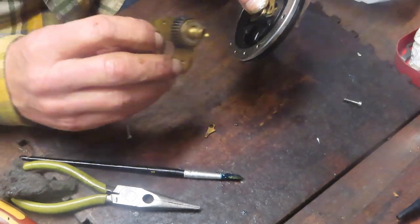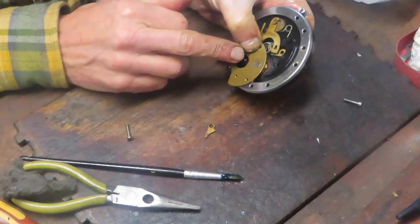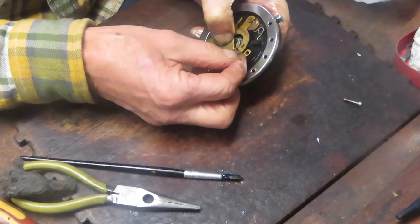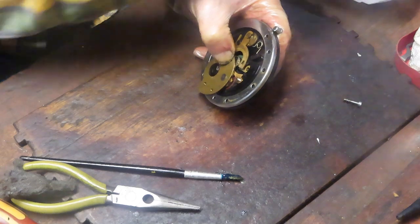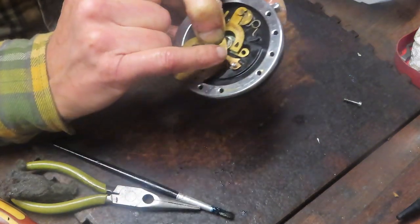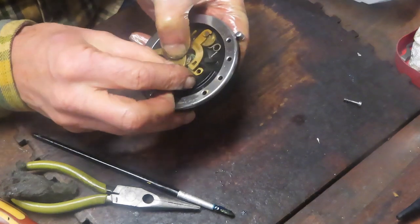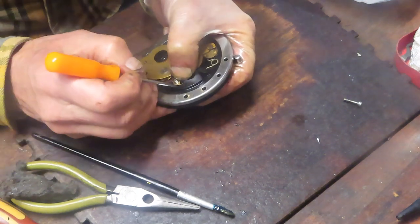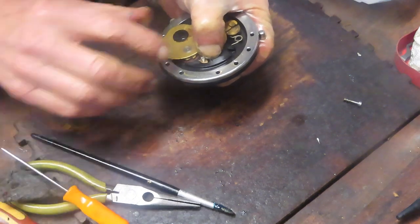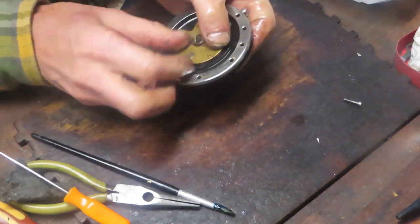We're going to find a fully threaded screw — we've already lubed up the bridge plate and everything is clean. Take that bridge plate, insert it in now, then turn your bridge so it is perpendicular to its finish and you have access to that corner slot. The fully threaded screw goes in, the dog goes on, and now that little annoying coil spring — the anti-reverse dog spring — goes in. To do that, load it into one corner of the dog. I choose the dog side rather than the plate side. Push that in and wiggle it with your fingertip to make sure it is properly seated. Use the spring pick to make sure it's coiled up flat with the bottom of the dog, then rotate the rest of the bridge over.